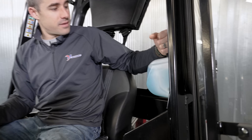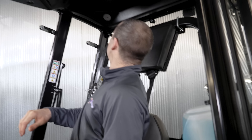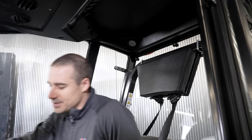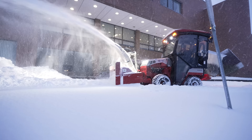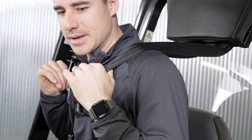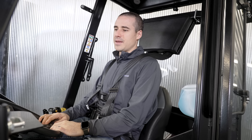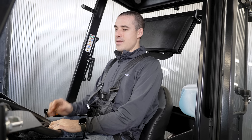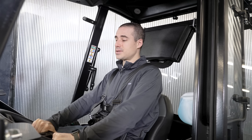This is your reservoir for your washer fluid — it lasts pretty long, so good access there. There is an additional kit for when you have the cab installed that gives the operator a headrest and a four-point harness. I would recommend giving yourself a little bit of space but also enough that it stops you — if you're using a blade or a snowblower and going really quickly and you hit a solid edge on a driveway or a heaved-up sidewalk, the tractor can come to a near stop pretty quickly before the blade trips. Keep your operator safe with the four-point harness.